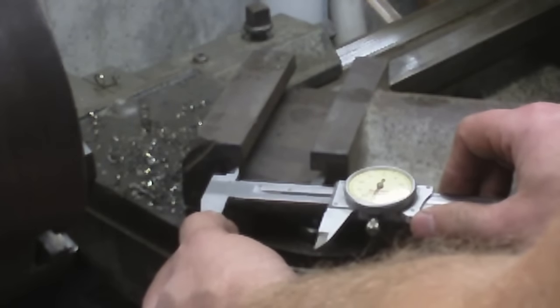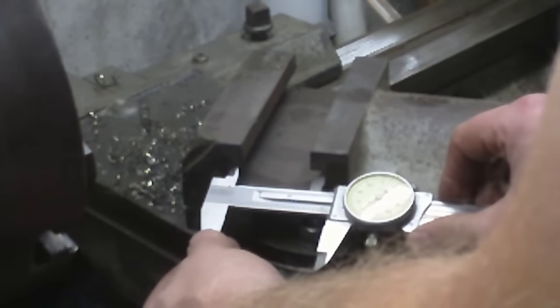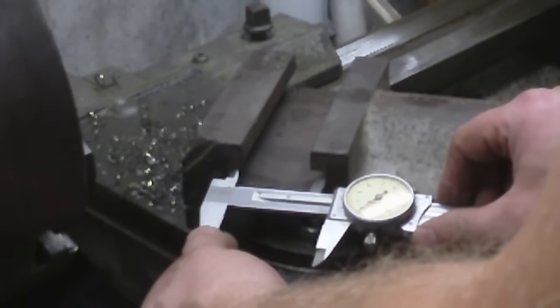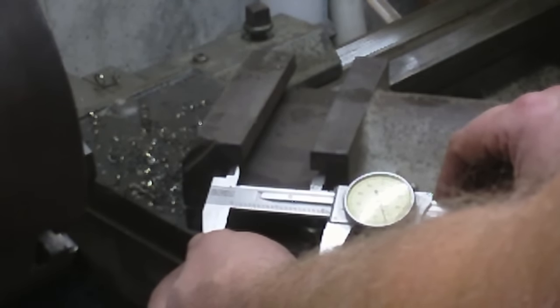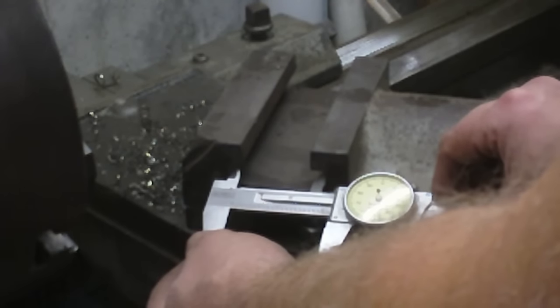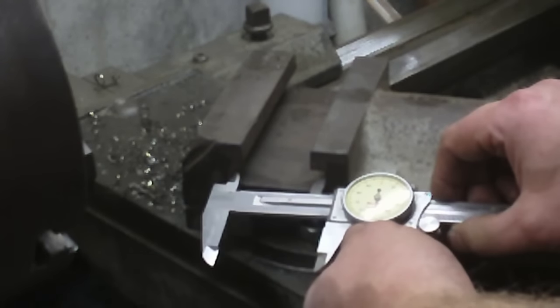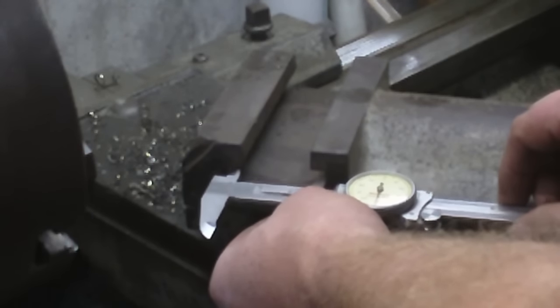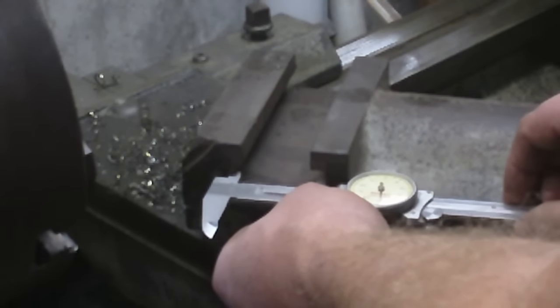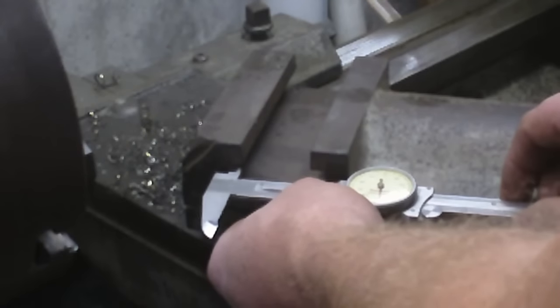of the wide part of the slot here. Of course, if I take the actual dimension of it, I look at that and I go, well gee, I don't want it fitting that tightly, I want a little bit of play. I'm so close to 50 thousandths that I think I want to just go with that. So if I set my calipers to the 50 and just lock them, and then I'm just going to take the jaws and, yeah, for some jobs that would be plenty sloppy, but for the job of the T-nut here I think that clearance is okay.